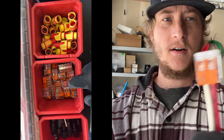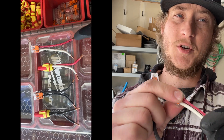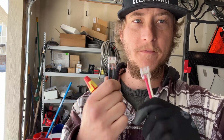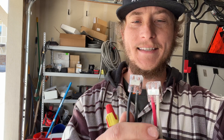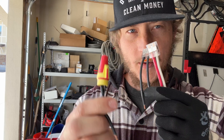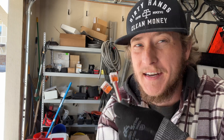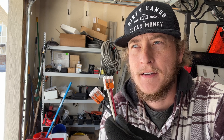This connection right here is pretty hard to mess up — you just strip it back and push the wire in. It's just common sense wiring up a Wago. I see a lot of failures with terminal blocks and wire nuts because they're installed wrong. Wagos — this is just my experience — I haven't actually tested pull strength or voltage overload capacity. From what I see, it's an inferior connection to a properly done wire nut, but there's more forgiveness. If you eliminate improper installation with an easier-to-install product, is it a better product? I think it is — the net result is probably fewer failures.